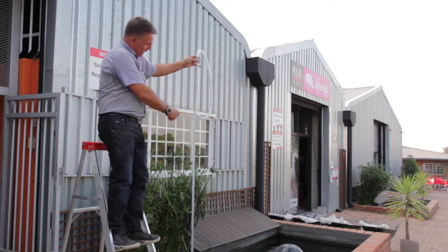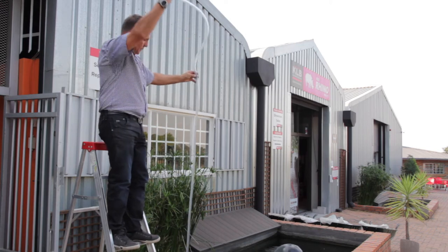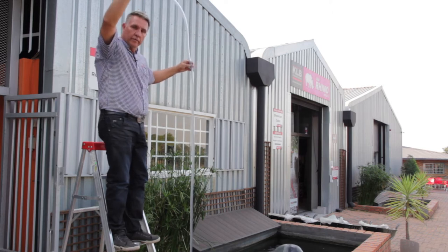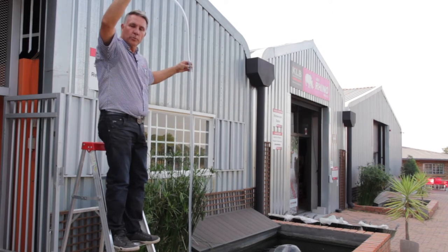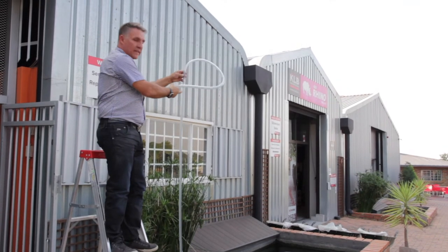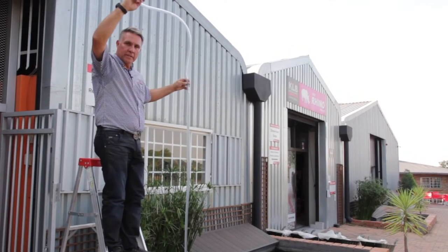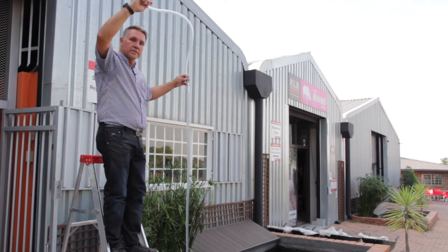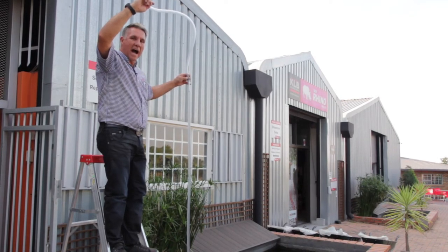There we go, you can see the water coming up and it shoots up to 2.3 meters. That's this Waterfall 2400, so 2.3 is maximum head out. It'll hold it there, but it won't come out of the pipe. That is what head out max means. So we'll see how to choose the correct pump depending on the height of your water feature.